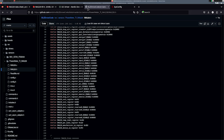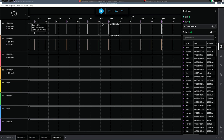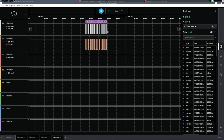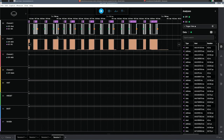Let me plug in the device, power it on, and get some readings. Looking at the logic analyzer, after every one second you can see the system is going to capture a couple of data points — the I2C is triggered every second. It's going to do a couple of readings, pulling the voltage of the bus, the current of the bus, the energy, the charge, and the temperature of the die.